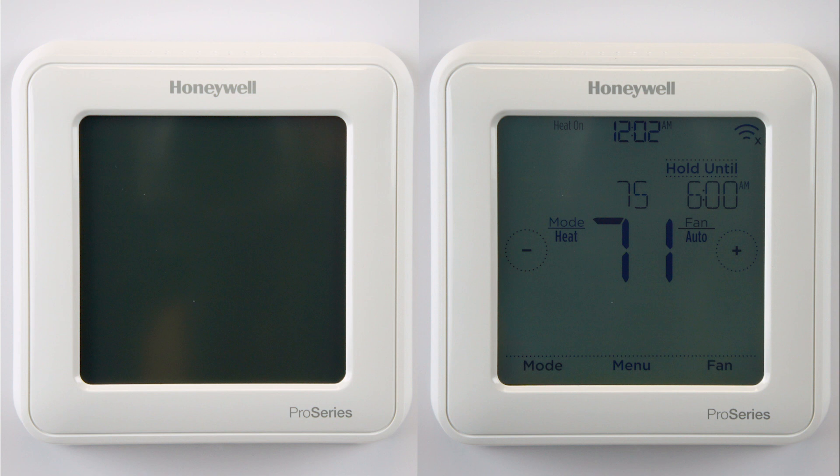The following troubleshooting would apply if your thermostat has no batteries and is powered by your HVAC system. If your HVAC system is not running and your thermostat is powered by your HVAC system but the display is blank, it can mean the power from your system has either dropped out completely or dropped below the minimum the thermostat needs. Because of that, the thermostat will not be able to call for your system to run.